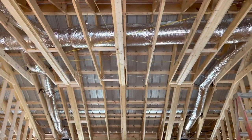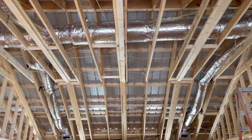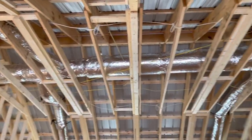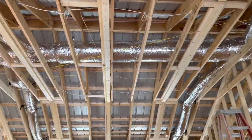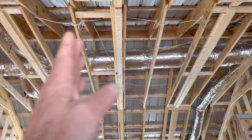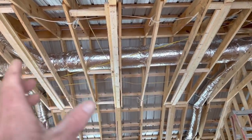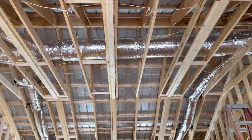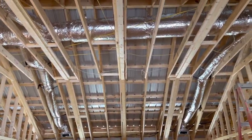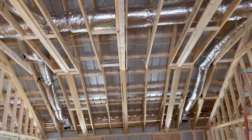There's a huge ceiling fan right in the middle with windmill blades — I don't know if y'all have seen them, but they're beautiful. Eight canister lights in the ceiling between these beams. You can see those two-by-fours — they're going to drywall between them, and then I'm going to wrap those beams with one-by-sixes and cap the bottom with a one-by-six, so it'll look like a six-inch beam up there, but it'll be false.